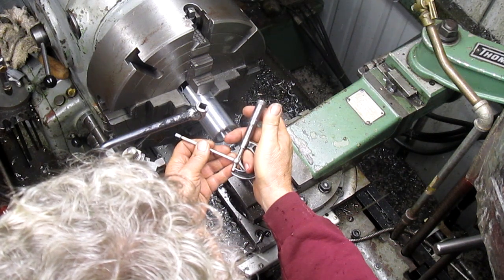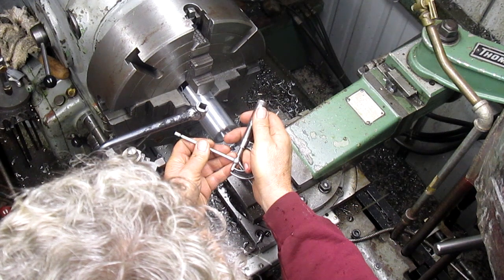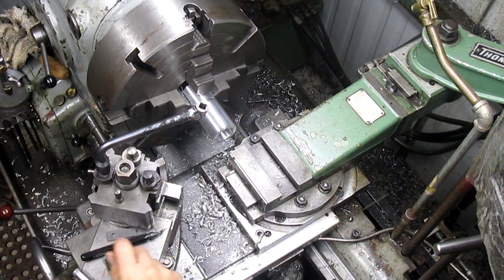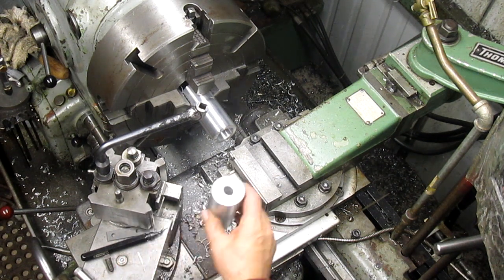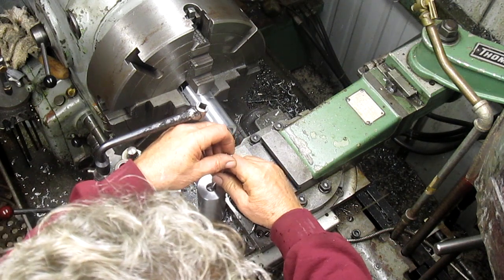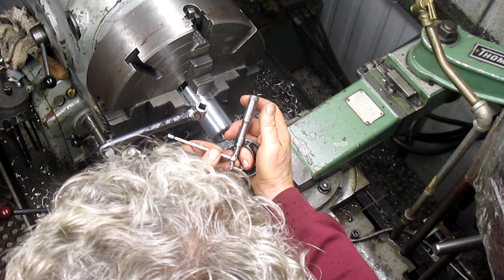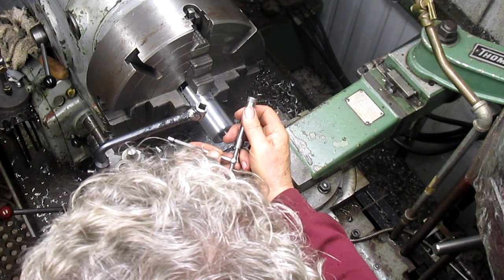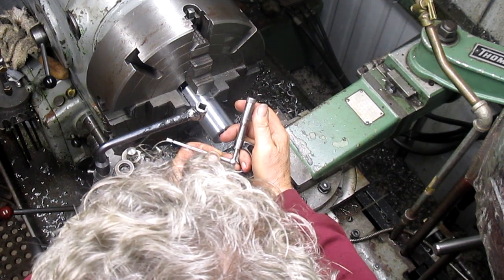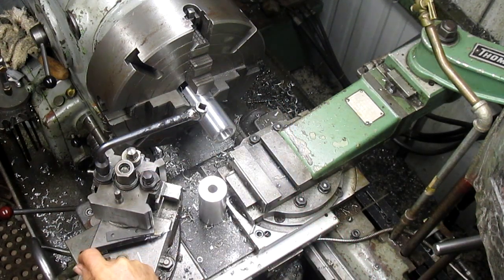One measurement I get 4/10 under, and the other measurement I get right at. Anyhow, we're a little bit under zero, which would be 625, 5/8. Now, the original sleeve that I so generously messed up measures at a thou and a half over. So we still got a thousandth and a half to go.